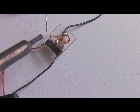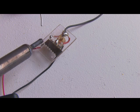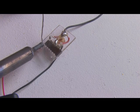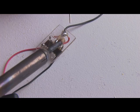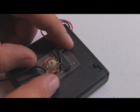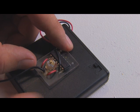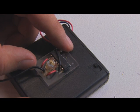Here are our last two connections. Our positive power goes over to pin 14, and our negative power lead goes to pin seven. And a little drop of solder. Our circuit's ready for action. A little bit of silicone glue underneath, or you can use Goop brand glue, and just glue it here to the battery pack. Then you've got a neat unit with an off-on switch that'll fit in your pocket, can go anywhere, easy to adjust right there. And you're ready to go.